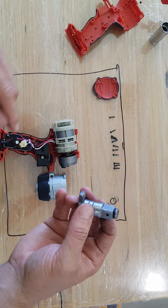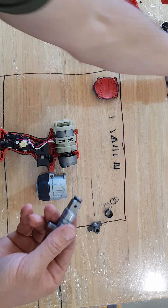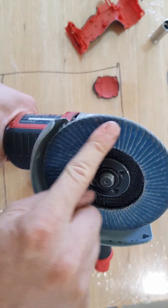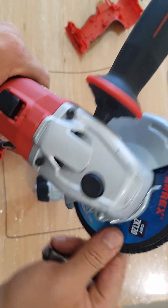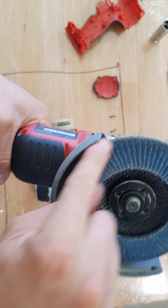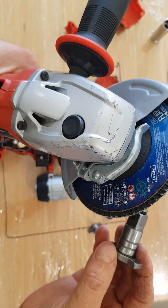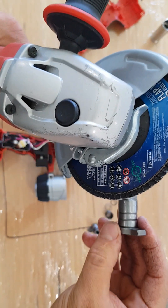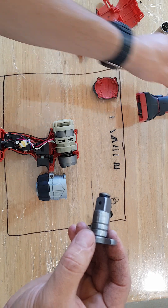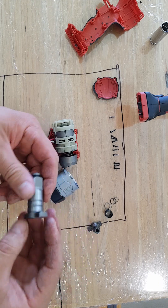Challenge number one: to grind it down on the outside because it's thicker — make it thinner. I used a brushless angle grinder with a flap disc from Aldi — it's 120 grit sandpaper on a flap disc. I'm not gonna do it now as I don't have the tools here, but basically I was grinding a tiny bit and spinning it, going around and around smoothly, keeping it as even as I could.